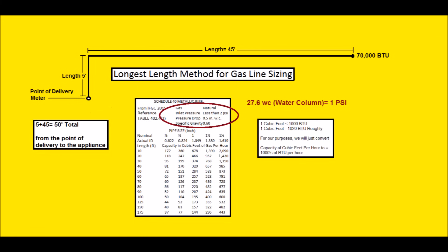The specific gravity of the natural gas here is 0.60. The reference chart we're looking at is out of the International Fuel Gas Code 2015, table 402.4-2. This chart shouldn't change too much during the next update — the 2018 International Fuel Gas Code usually doesn't change the charts, as updates are typically to codes that don't have to do with gas line sizing, though it's possible they could.